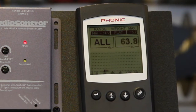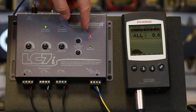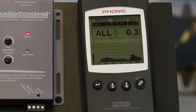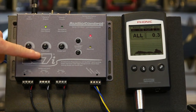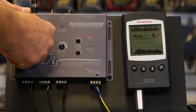Let's take a look at the subwoofer — boom, clearly just a sub channel, which is fine because all this channel is going to do is power a subwoofer. Now let's see what that looks like on the unit. We have our tweeter, we have our mid-range. We can use the output levels to adjust — bring up the mid-range a little bit, bring up the tweeter.